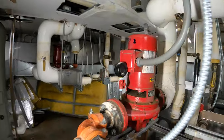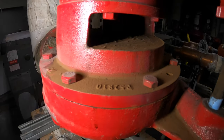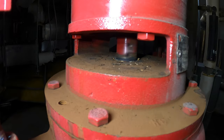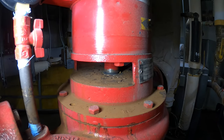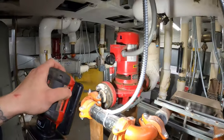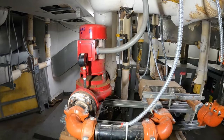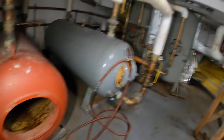There are four pumps in total — this is the fourth one. Looking at how stained it is with rust, it looks like there's been leakage at some point. This thing is probably done. The best plan is to put this one in place of that one, rebuild that one, put it in place of this one, then rebuild this one and keep it in stock as an emergency spare. Let's shut this down.